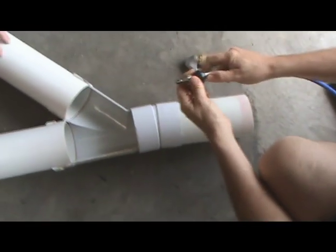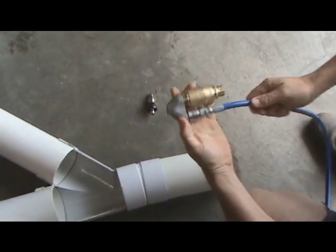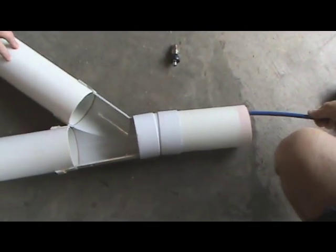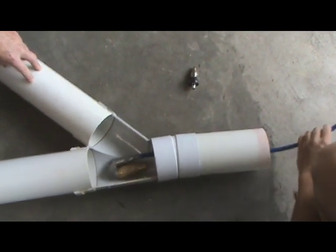However, if you put the root cutting turbo on, when it gets in the drain it sits up on an angle quite aggressively. So it comes up a drain like this, and you're coming up slowly with it. If you're going quick, it'll go straight past that junction.